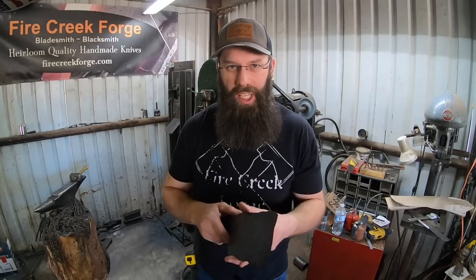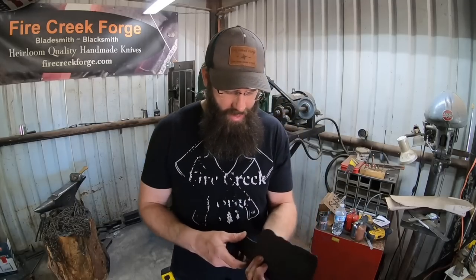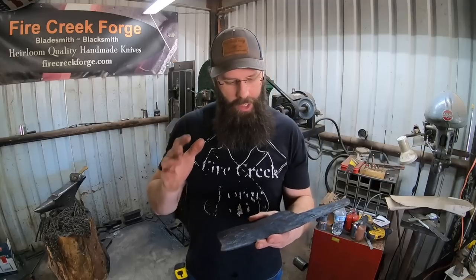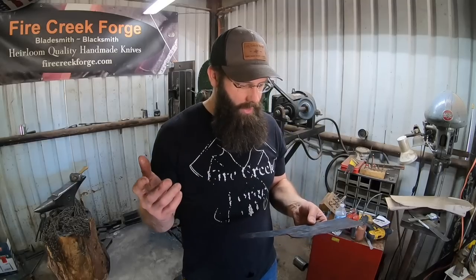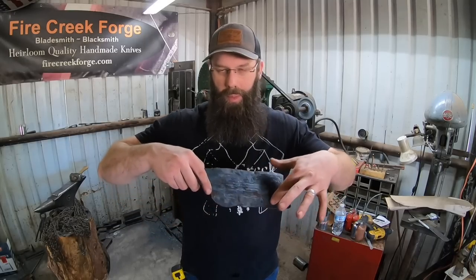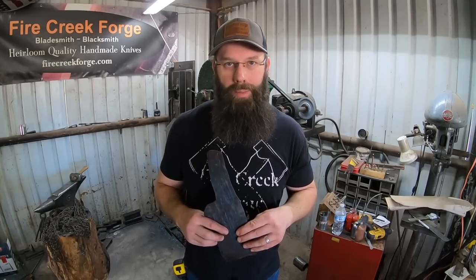Had some low forging heats, came back and did that several times. I hope that's going to help a lot. I think it will. It's still a nice thin forged blade, but I'm going to go ahead and heat treat this, figure out how well this is working before I end up forging any more. And first thing I'm going to do is clean up the profile a lot here. Got some material all the way around to remove, and then we'll normalize this thing and see how it goes.